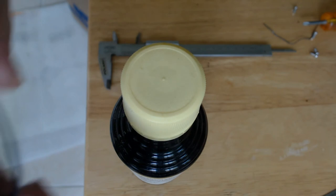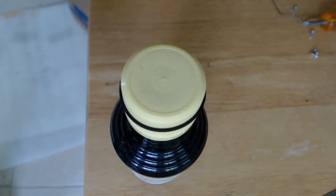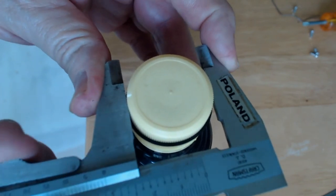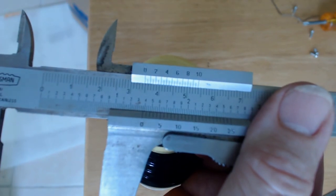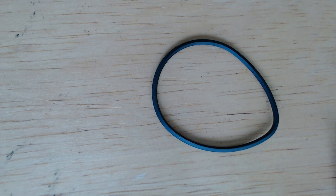Back to my first scenario. Here's a method I recommend to determine the belt size you actually have right now. Try and locate a suitable size container or container cap that is almost the exact size that the belt is. Slide the belt over the top of the cap and then use a ruler, or better yet vernier calipers, to measure how big the belt is on the inside diameter. Next step is to hunt up a belt that is one size under this exact belt size.